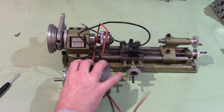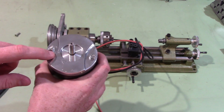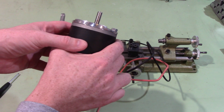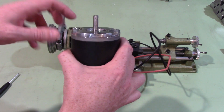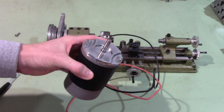One other thing you probably can't tell in the video — I've been kind of polishing this as I've been going just so I can see what it looks like. But it's a little rough and it's actually not perfectly flat on this side. The nut is sitting a little bit crooked, which I don't want. So I'm going to clean this up a little bit more and re-polish it, and then we'll come back and see how it fits.